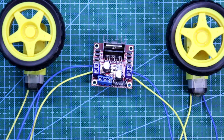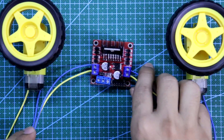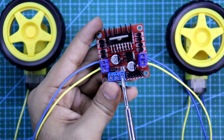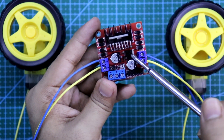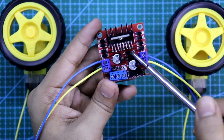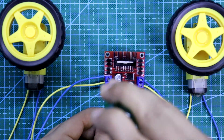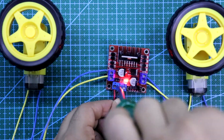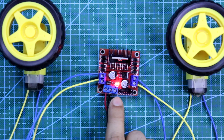Now for this time I want to run my motor at 9V so I will connect 9V here. If the jumper is here then I will get 5V at this point. This jumper means this 9V is connected to the 7805 voltage regulator IC, and this regulator IC converts 9V to 5V, and this 5V will be available here.